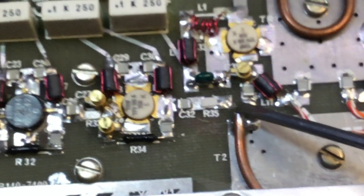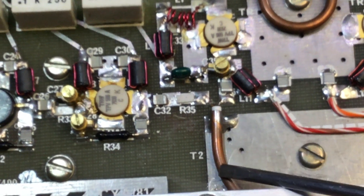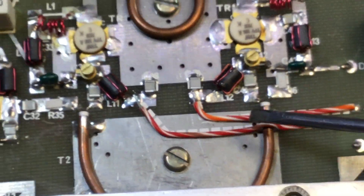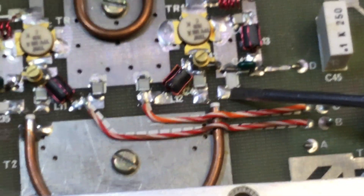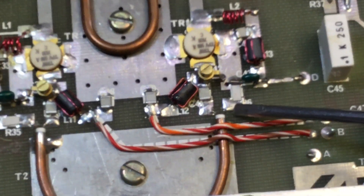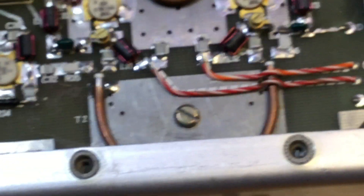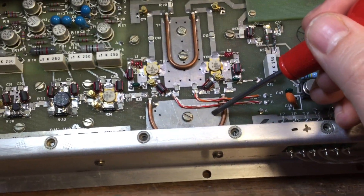After another feedback circuit and RFC, the signal decouples into another 50-ohm resistor before entering the transformer. This transformer isn't just a single rigid piece of coax — it has two inner conductors, one on the right and one on the left, and likewise on the output. These transformers are cut to a quarter of the wavelength of the center frequency that we want the amplifier to work at.